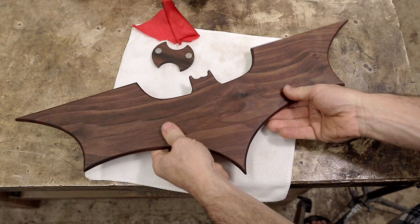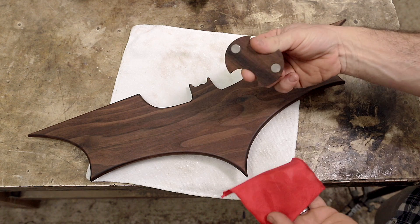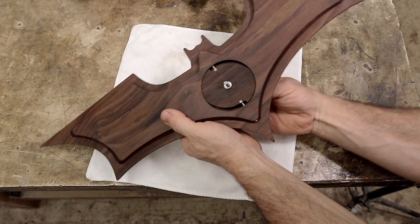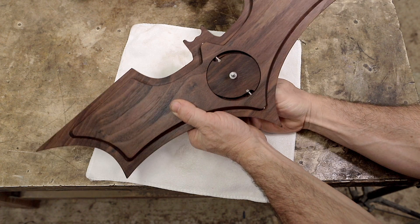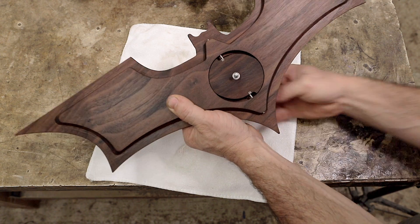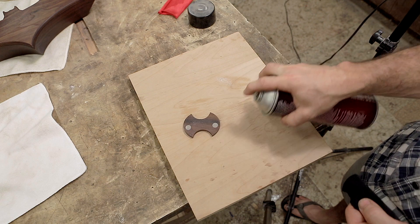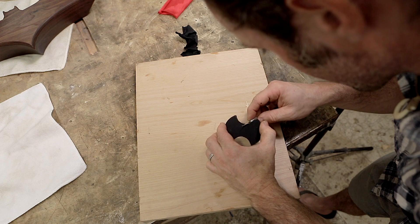So let me show you how this works on the other side with the key and the magnets. I'm going to use a piece of cloth — I will eventually glue a piece on, but I want to show how it works first. The magnets line up with the other ones on the inside in those grooves and I can flip it over and show you twisting the key on the top — pushing it out to lock, pushing inwards and the magnets suck in the pieces to unlock. Locked, unlocked, locked, unlocked. The last thing I had to do was put a little bit of spray on a piece of cloth and attach it to the back of my key to prevent scratching on the top. I put a little bit on, let it dry, and added the cloth, then cut out around it with an exacto knife.